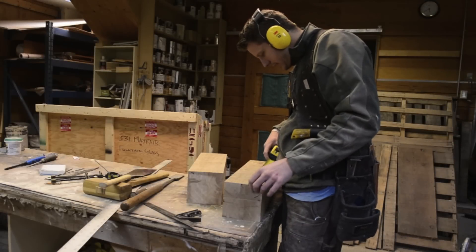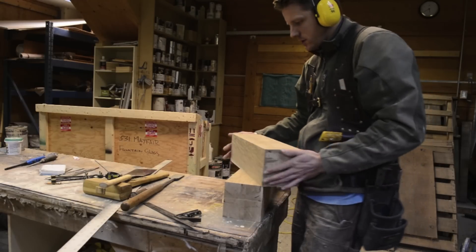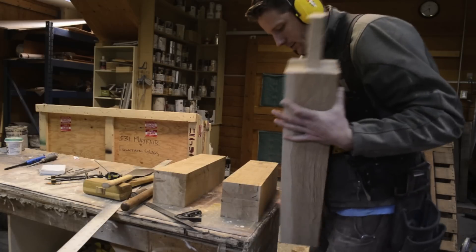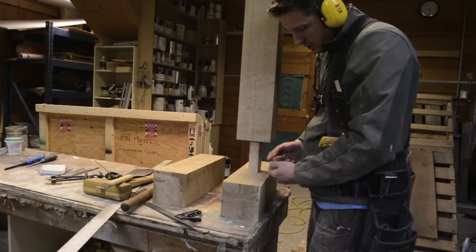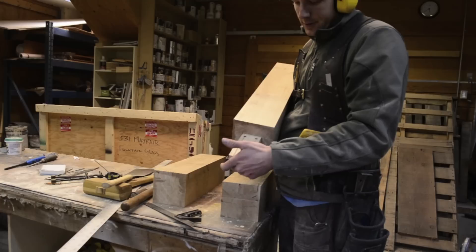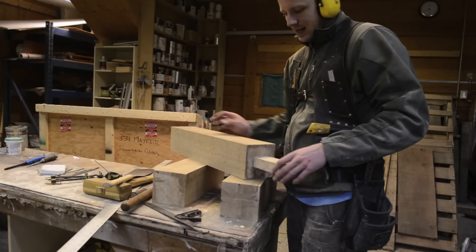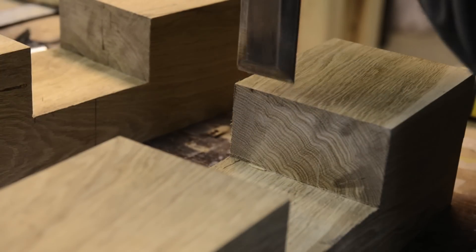My two base pieces are about 18 inches wide. I'm laying out the half-laps so they'll be notched out and sit down flush. My post, which holds the anvil, has about a two-and-a-half-inch wide by an inch-and-a-half thick tenon on it. I'm going to cut a mortise through both pieces once they're lapped — the mortise will have a slight taper, then I'll pound wedges into these two slots. All done with a chisel, handsaw, skill saw, and drill. No bolts, no fancy hardware — just all wood. It takes more time but it'll last twice as long and look twice as good.